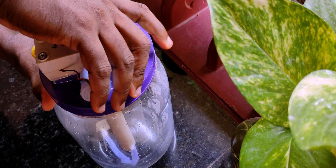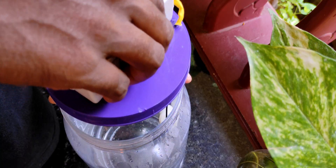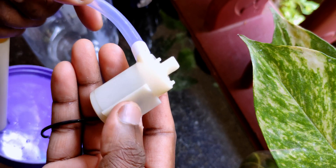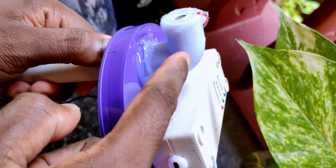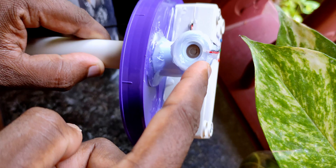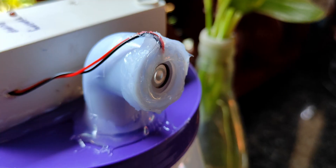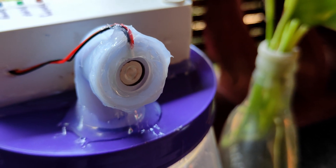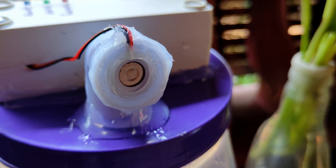For the tank, I used a large bottle that can store up to 3 liters of water — I know, that's insane. I used a 3-to-6 volt mini submersible pump to pump the water into the back of this piezo. It's a 108kHz piezo atomizer disc. According to the manufacturer's spec, there are 740 spray holes and each hole has a diameter of 5 micrometers.